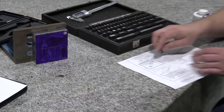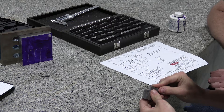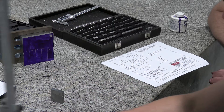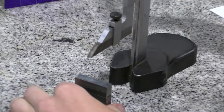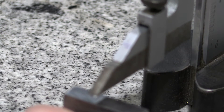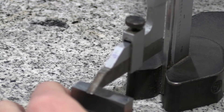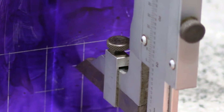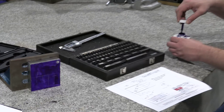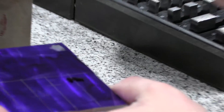Your last intersect is at one and a half inch, so you want to wring those two blocks together and intersect your third line. A little bit of advice: that fourth intersect is going to end up biting you when you get to the machine, so go ahead and blur it out so you know not to center drill anything there.